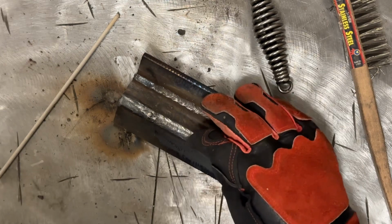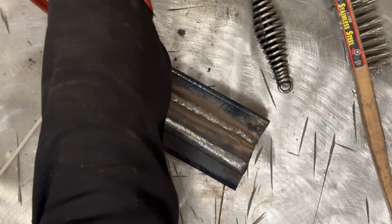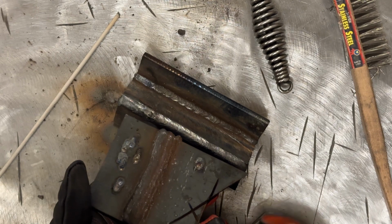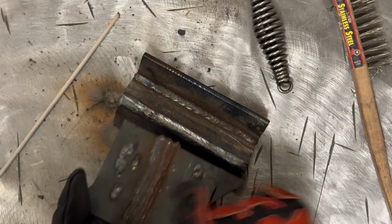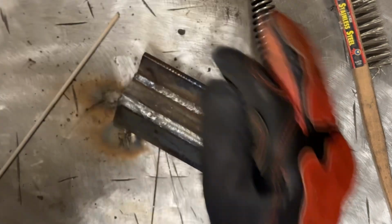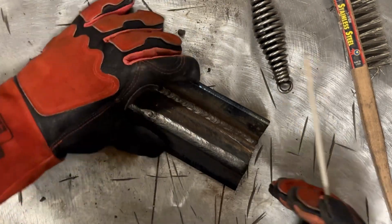Now what we're going to do is, on your lap welds like this, where we're stacking bead and bead on plate, and not lap welds, but just padding beads, if you can keep them this tight together, you can weld this groove weld without any issue. It's a little bit different. It's going to be a little bit harder.